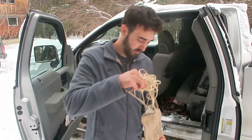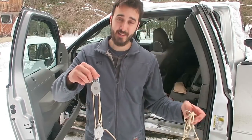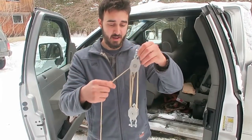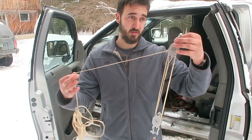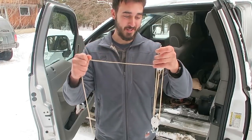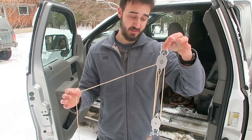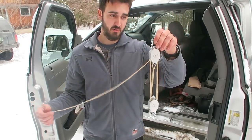In this little bag, it's called a Nifty Lift. A while back, a guy by the name of Albert emailed me — he watches these videos. He said, 'I've got this product, it's called the Nifty Lift.' Essentially, it is a block and tackle system that gives you a mechanical advantage to lift up heavy objects. Say you have something that's 500 pounds, it's going to take probably about 170 pounds of force to lift it. This tiny rope — this little shoelace-looking thing — has me questioning it. But block and tackle systems, they've been around forever. I believe Archimedes was actually the one that came up with this. You see them a lot on boats. Lumber yards use them, that kind of stuff.